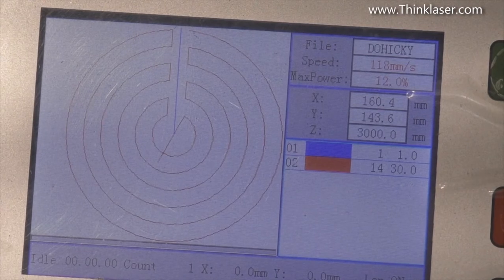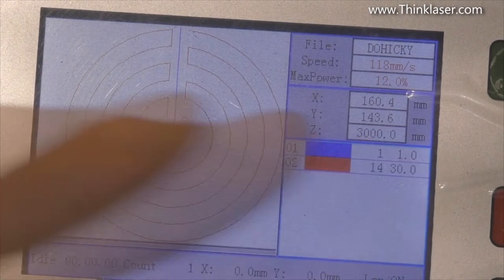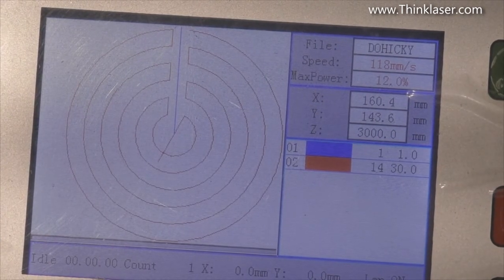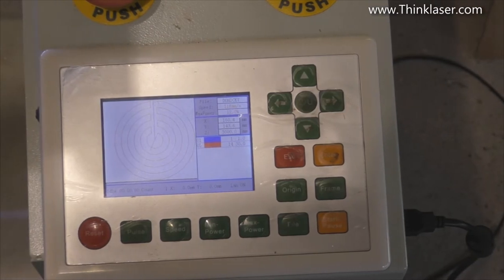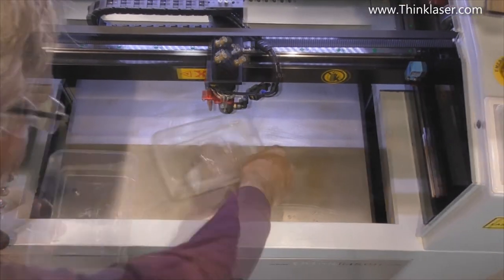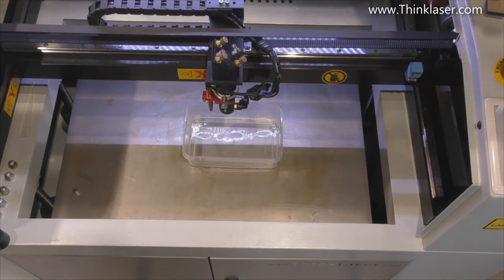That red spiral has been very carefully designed — its length and speed are set to 14 millimeters a second — because that will give us the correct amount of exposure time for the calibration to work. We don't have to panic when we press the start button because over the blue line for the first 10 seconds the power is set to 1%, which will not fire the laser. We have a little bit of relaxation time from when we press the button to when we go around to the back of the machine and get ready for the test to start.